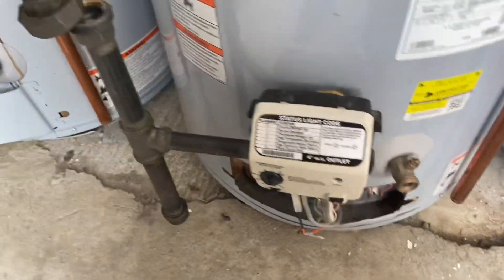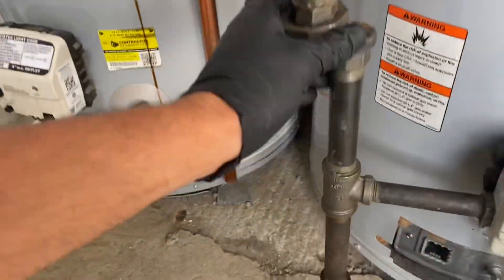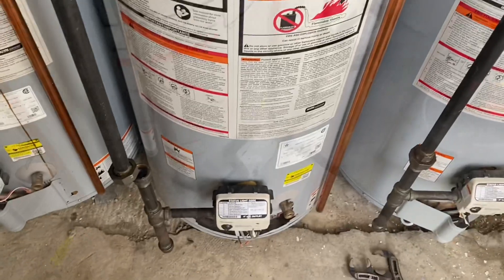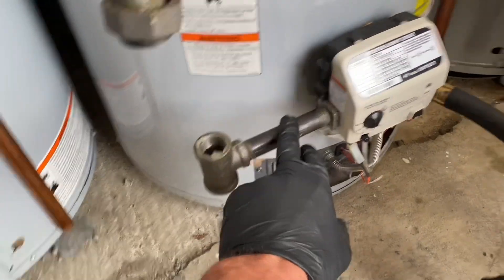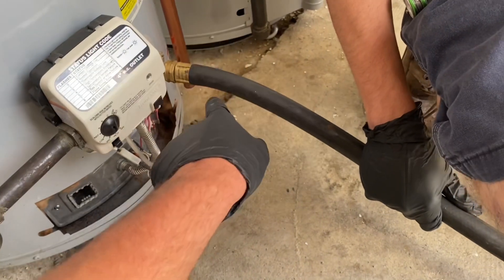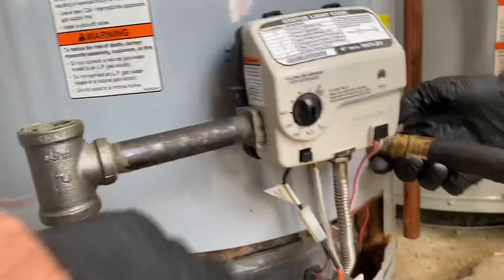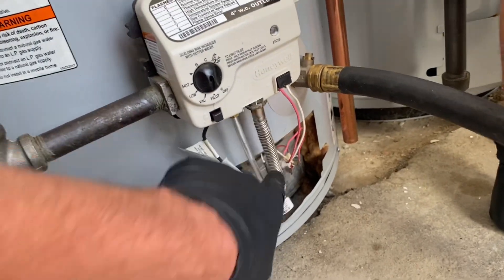While Daniel's getting a five-gallon bucket and a little hose, I already have the cold water supply isolated, the gas is off, and I just disconnected the union. Now we're going to start disconnecting the gas. The union's cracked off, piping's off. We're going to take out this nipple — I'm using a full-flow washing machine hose going right outside just to take the pressure off. We'll take out this nipple, the control wires, the rollout switch wire, and then the main gas and pilot tube.